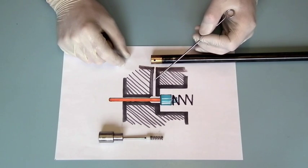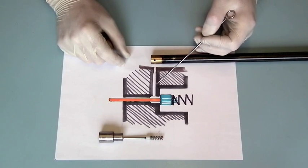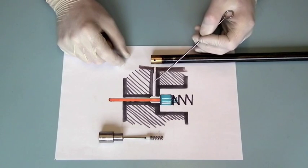Now, if you're going to try and get the most number of shots out of your tank of air, this will require the regulator pressure to be dropped, and some people who go to the absolute extreme will drop this down to as low as 60 bar, but that is an extreme. Normally a low setting would be 70 to 80 bar. They would enlarge the size of this transfer port to a maximum of around 4.3mm. But that is only if the regulator is to be set at a much lower setting.